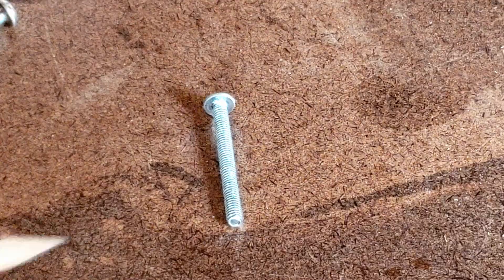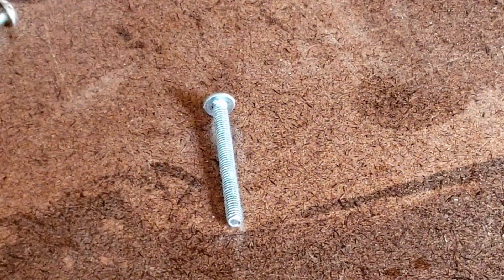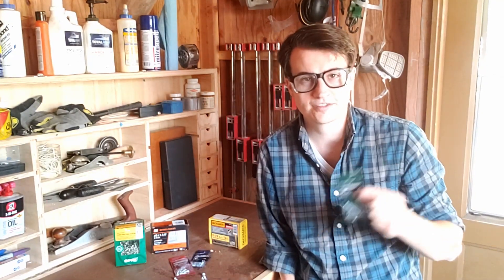Let's begin by talking about machine screws. Two main features you'll notice: the tip is flat and the threads are evenly spaced along the shaft. This is because a machine screw is never going to cut its own hole. Rather, you would either put a nut on the end — these come with their own nuts — or the machine screw goes into a hole that's already been tapped, meaning someone has already cut threads inside the hole that match the threads on the screw. This is commonly seen in things like cabinet handles, appliances, or electronics — things that come with their own set of screws. Machine screws come in either zinc plating or stainless steel. Both can resist rust, but stainless steel is a bit better because the zinc is just a coating and if it's damaged the coating is less effective.